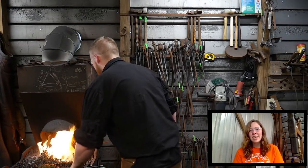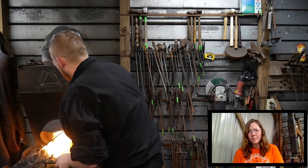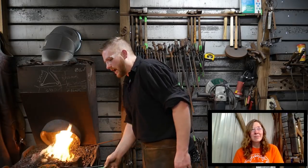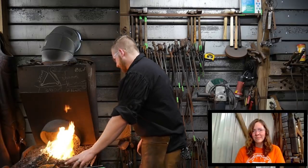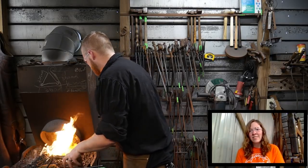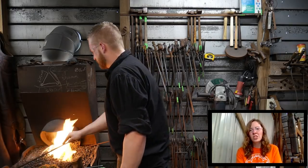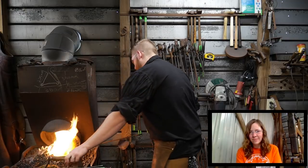RC Development says he uses welder's builder sand. Yep. That has to be put on quite hot, almost at a welding heat. Evan Coughlin says it's a waste of time to bake out the borax. Unless your forge is turned off, the moisture won't stick around for long. Yeah.